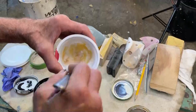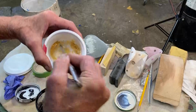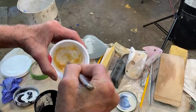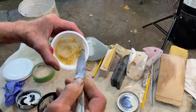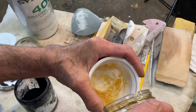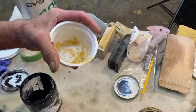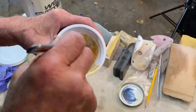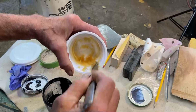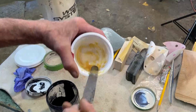Okay, there we go. See? Smash this together. There we go. Make a paste like this. Yep, I always do that. Put a little too much of one thing. This is for demonstration now. I did all the boo-boos in the piano, but if you're a woodworker and you're French polishing a finish, this is very, very, very compatible.